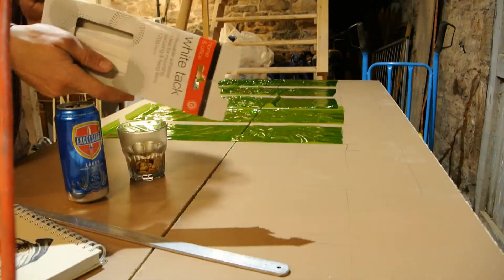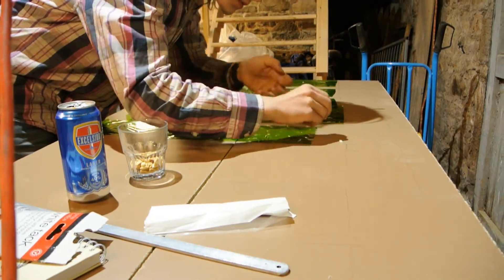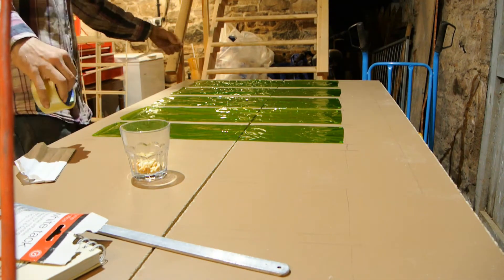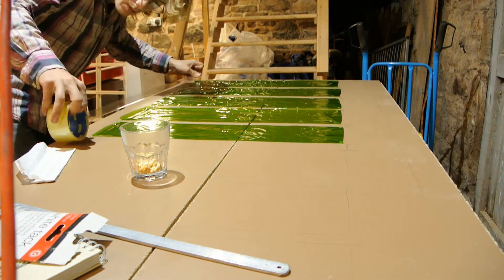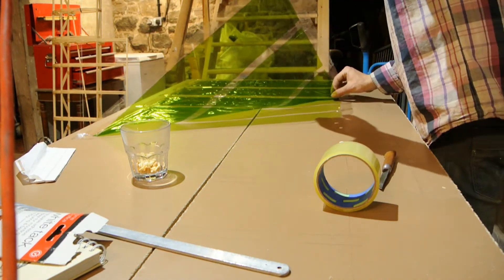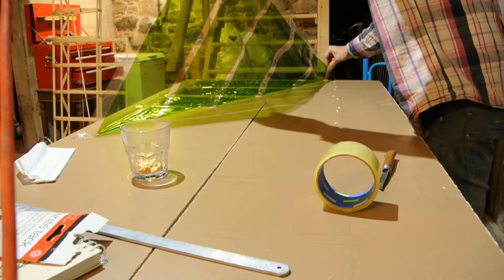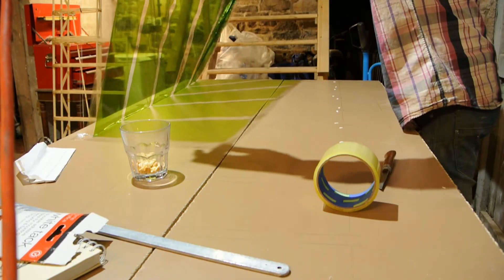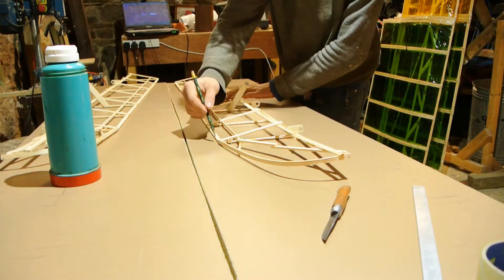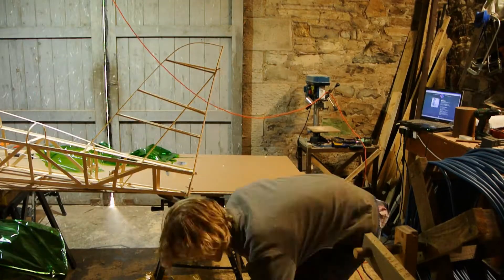It's very hard to tape down a piece of plastic, as the plastic jumps up with the static to touch the tape, making a mess of whatever you're trying to do. I later found out it's much more effective to blu-tack down your cellophane, lay tape over the top, and then peel up your panel. This construction technique could be made aircraft-worthy if you used fibreglass reinforced tape — then you'd have a quite reliable composite. I was later recommended ex-military parachutes, as they're made from a perfect aircraft material and they're of a very affordable price for the square footage of material.